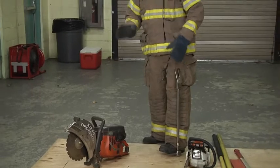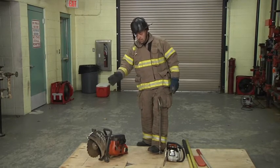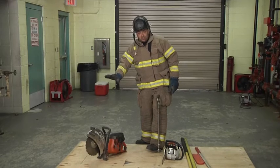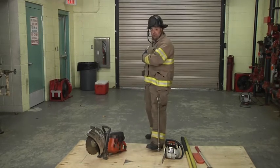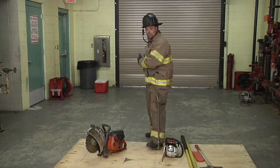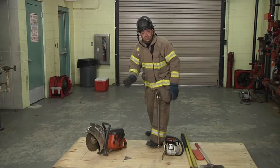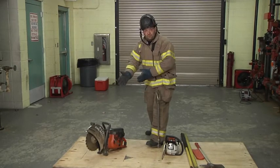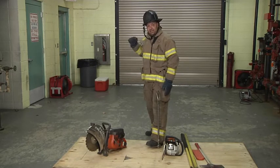One more very important thing is the individual watching the cutter — the spotter. While the cutter is making cuts, we want to keep in contact with that individual at all times, hand on. If the hand is on, we're ready to cut. Once my hand comes off, cutting should stop immediately. That could mean I lost my footing and fell backwards, fell off the edge of the roof, or a chief officer wants my attention. If I turn to look at a chief officer and I'm no longer watching my individual cutting the roof, I'm not paying attention to his or her cuts. So once I turn my body and I'm no longer in contact, no more visual contact — I'm not really a spotter anymore. Hand on, we're ready to cut. Hand off, cutting stops.